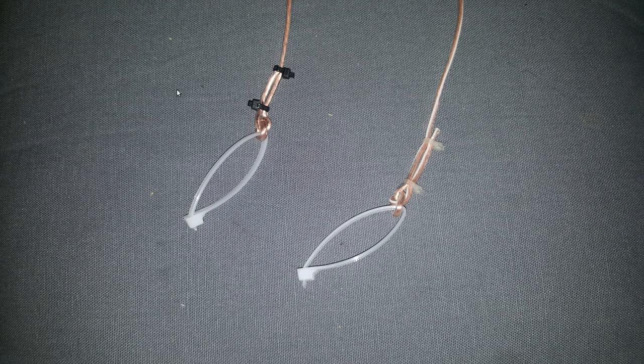So anyway, what we're looking at here, it's going to have two counterpoise wires drooped down. An elevated vertical with a ground plane that's at right angles to the radiator will also have a source impedance of, am I mistaken? Yeah, 37 ohms. That's why a dipole has an input impedance of about 72 ohms in free space. The vertical is half of that, right? So I want two support wires which serve as counterpoises, drooping down and staked to the ground.